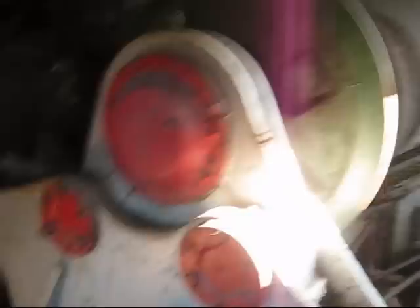Here's your drums right here. This one's your hoist — to basically reel the cable in. You can see the lines in the drum; that helps when the cable's being reeled in so it finds a place for the cable to line up and doesn't get all tangled up inside the drum. They make their way out to the boom out there. Here's your other swing motor right here. Now to make your way up to the cab — another electrical panel.